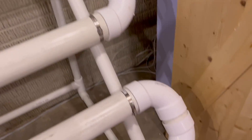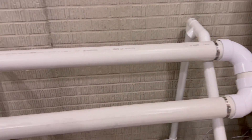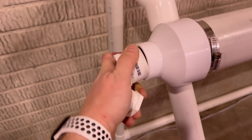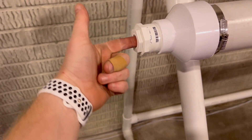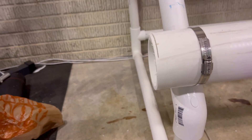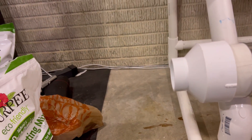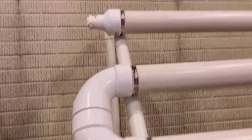I've got my pieces in — nothing's glued in at all, just a disclaimer. I'm going to take it all apart and glue it together when I'm done. Now I need to grab my other PVC pipes. One goes right up top — this will be the main supply line coming in. I have a reducer going into another reducer so my main line can go in. Down at the bottom I have my three-inch, so three-inch to inch-and-a-half, pop that on, then an elbow pops in and that will drain right into my bucket. That's the system.